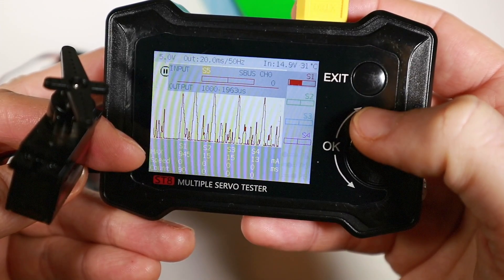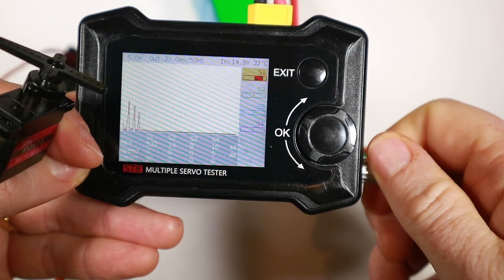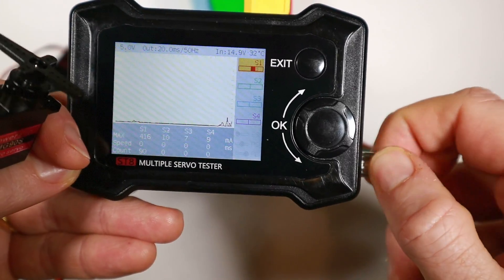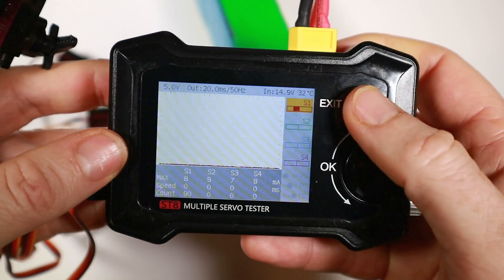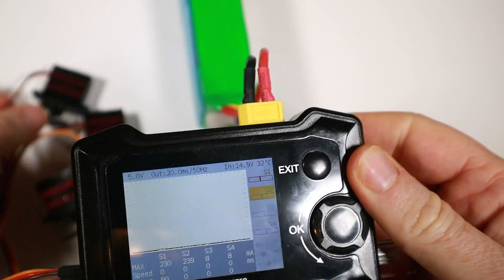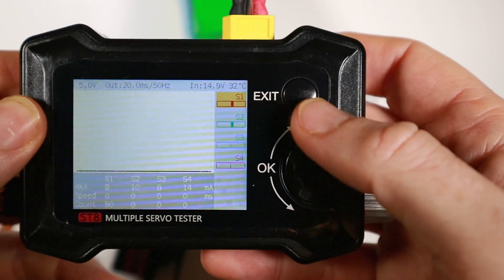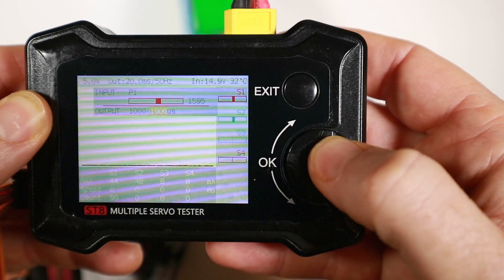Aside from those internal modes, we can change the input to P1. P1 is this little rotary knob which hides away when you don't want it — we can use it to move our servo. There's a little notch where it centers, though it's not exactly on 1500 but close enough. We can also set another channel to be controlled by the same knob, so now we've got two servos doing their thing together. We can also change the range of the output if we only want a servo to move a certain distance.